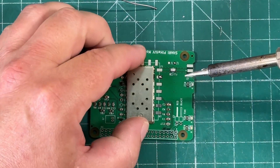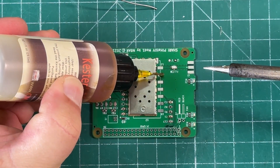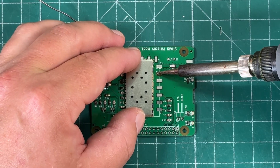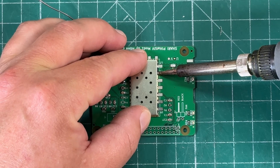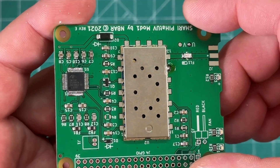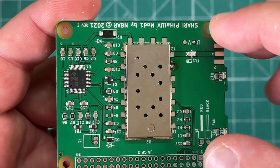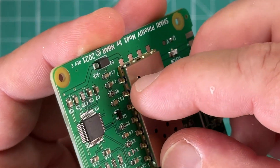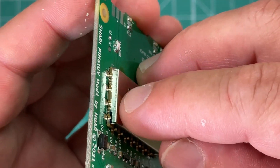We're going to tin pad 13, add a little flux so we can get that reflowed, get a little more solder on there, then reheat the solder, slide the board in, and make sure everything's aligned. We can continue soldering the rest of the pads starting from 1 through 7 and then 12 through 18. The instructions say we want to create a short to the shield of the radio module on pins 7, 9, 10, and 11 as well, so we're going to do the top last.